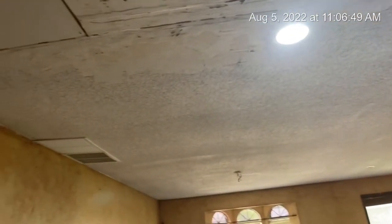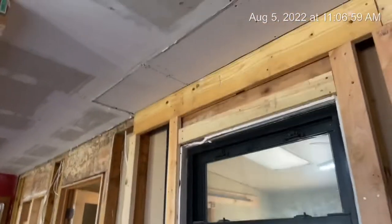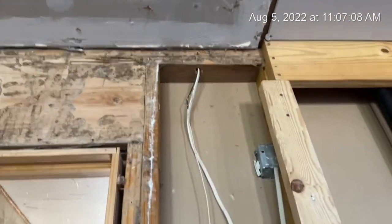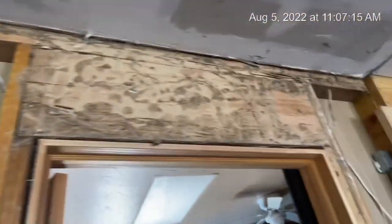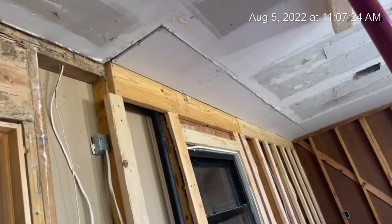You can also see how right here it kind of bows down a little bit, and then over here, see how much straighter it is on this side than it is over there? You can see a bunch of swooping and wavy ceiling. We'll be able to see it better when I take down the popcorn, but today my main focus is getting this wall done. I thought I'd go ahead and show you guys how I'm doing it because maybe some other people need to reinforce a load-bearing wall without moving it or changing the top plate. This does make it come out an inch and a half — the width of a 2x4 — but it gives it a lot more structure. You can definitely tell it picked that wall up over there.